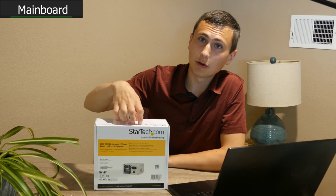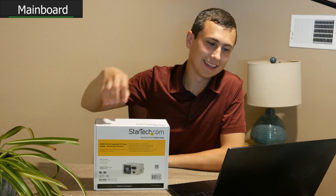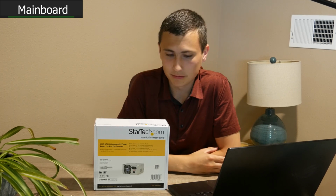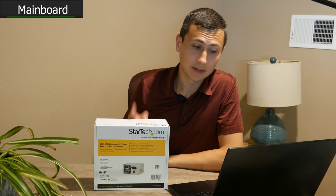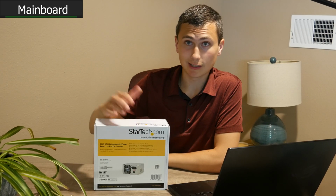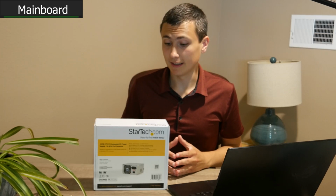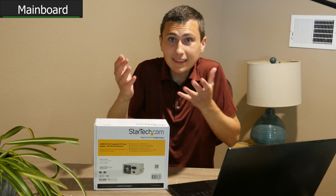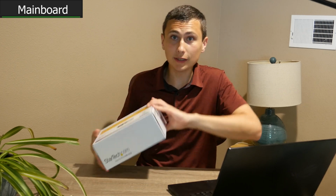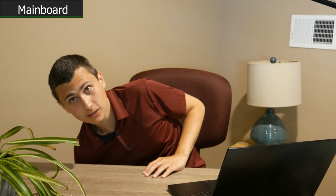We're going to use the ATX 24-pin connector to get the power into the electronic load mainboard, and then we will break it out from there. More to come in future videos. The power supply will mount where the power supply goes in the computer chassis, the water cooling radiators where the radiators go, the fans and so on. It's just everything has its place, and we didn't really need to build it because that is how this works.